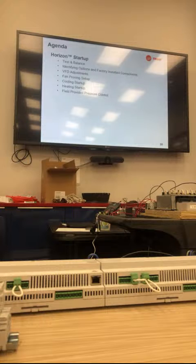Going back to this Y1 space lockout, if my space temperature drops 3 degrees below set point, you cut the compressor off so we don't overcool the space. But moving forward, if our space temperature starts to drop, we drop our evaporator, and then our discharge air temperature will go up because we're getting more reheat capacity. So we're trying to prevent overcooling the space by dropping our off-coil temperature, but it gives us more reheat capacity out of the unit itself.